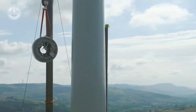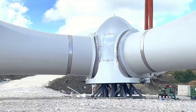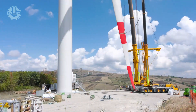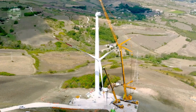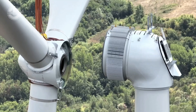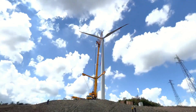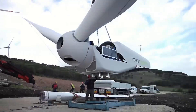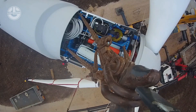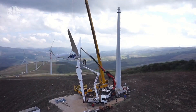To manage the weight and bulk of the blades during transit, these vehicles are outfitted with cranes and outriggers. Strong cranes are used to offload and hoist them, with heavy lifting apparatus such as mobile cranes utilized for lifting each blade one at a time to the hub level. The bases of each blade are firmly fastened by technicians using bolts, pins or clamps to the corresponding slot on the hub flange. The alignment of the blade with the hub is checked to guarantee the best pitch angle possible for effective wind capture. This technique requires exact alignment and torque control. The blades are fastened with strong bolts and specific locking mechanisms to protect workers and ensure the blade withstands wind forces and vibrations.